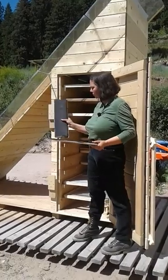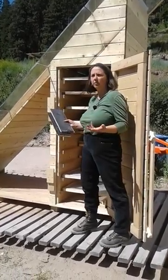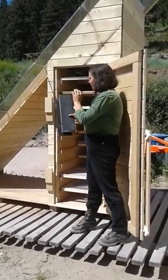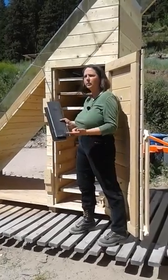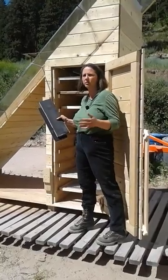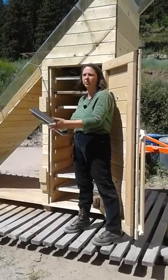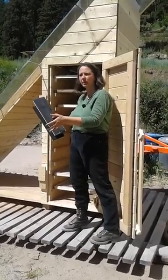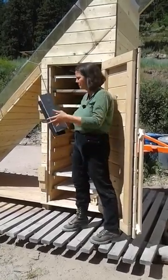So yeah, this is sort of a classic milk paint recipe that's made like for the old dairy farms. They'd use a milk paint for whitewash and barn paint and things like that. It's made with 2 gallons of skim milk, 2 cups of white vinegar. You stir those up together, let them set for at least a couple hours. I think we did it overnight. Then you strain those curds through a fine cloth, like a muslin or 3 layers of cheesecloth or something like that. Butter muslin would work perfectly because that's what it's for.